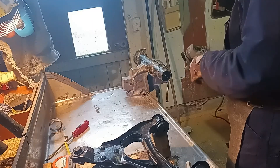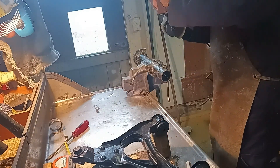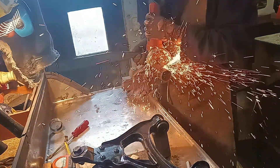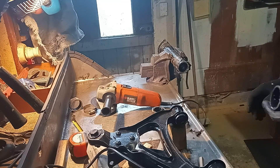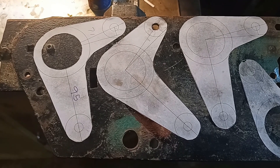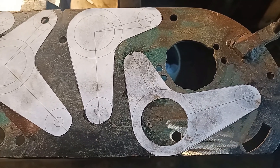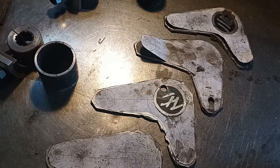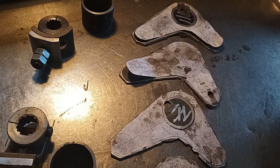Let's get into it. Right, that's two blanks. And what I hope is a prize for recycling — the bell crank sides will be cut from this very dodgy and well-used piece of three mil plate, eighth inch plate. The blanks are made and now it just comes down to neatening things up, assembling and tack welding them together.